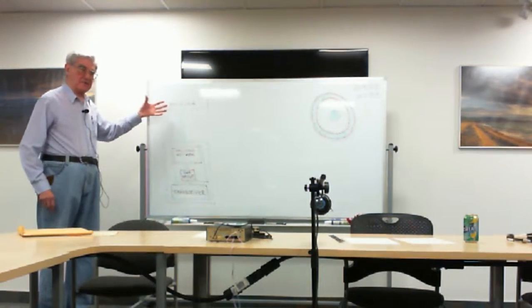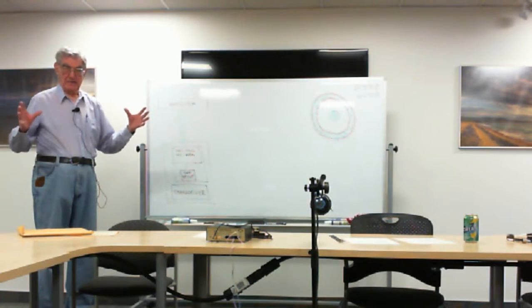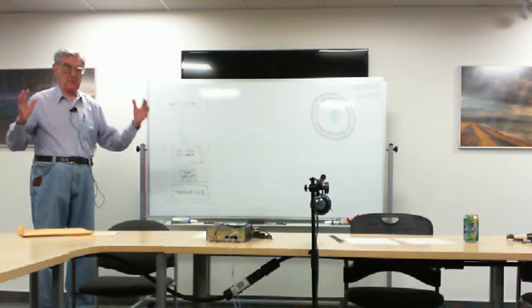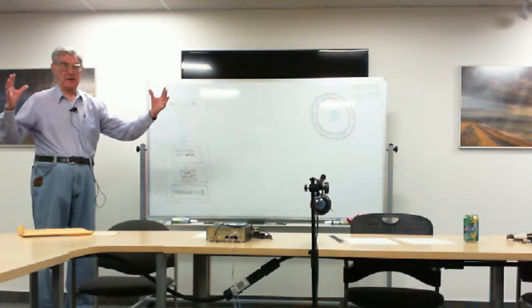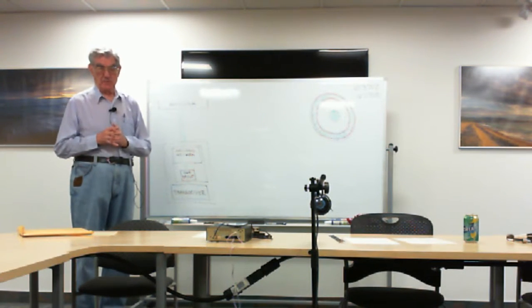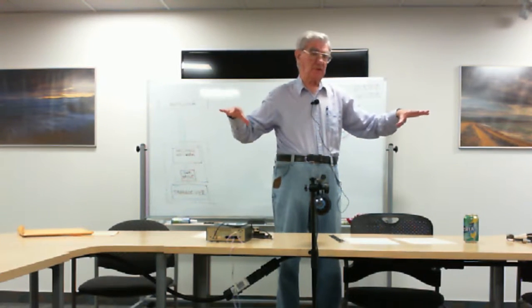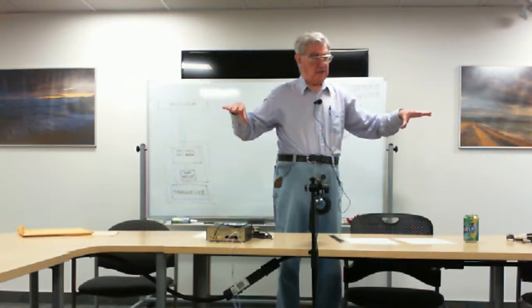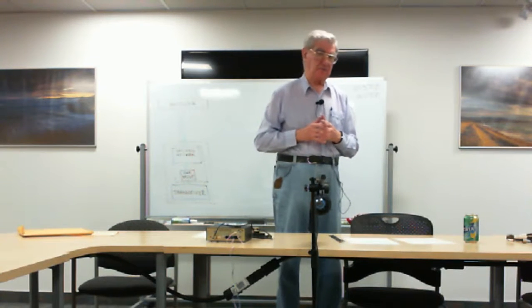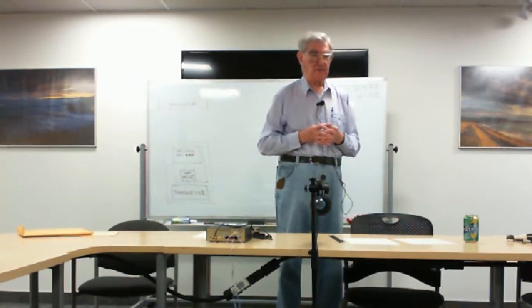What I've talked about here almost exclusively is a dipole antenna as normally used for the HF frequencies between 3 and 30 megahertz, and the IC questions about transmission lines focus on that particular situation as well. But another antenna that's very commonly used is a vertical antenna. Now, a vertical antenna is actually a monopole antenna. It's just half a dipole mounted vertically, and a proper vertical monopole has a ground plane underneath it. That ground plane is normally achieved by using radials. And as you might expect, the characteristic impedance for that would be half that for a dipole. And in fact, it is. It's around 36 ohms. Well, there's no coaxial cable made that's 36 ohms that I've ever heard of.